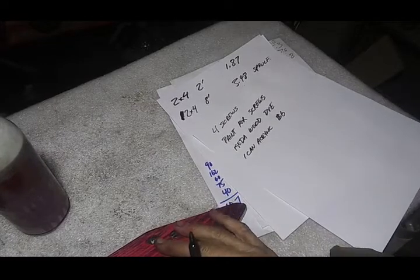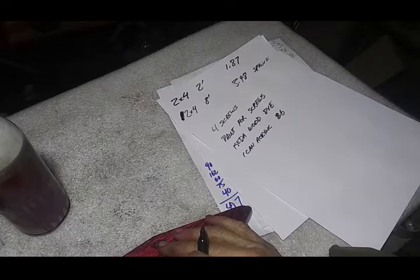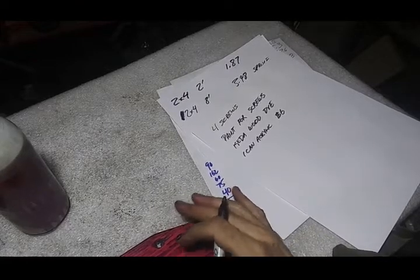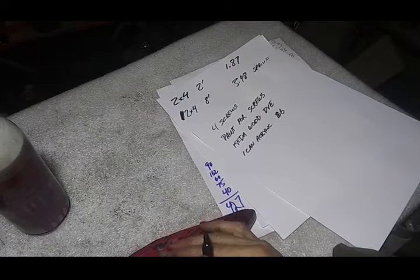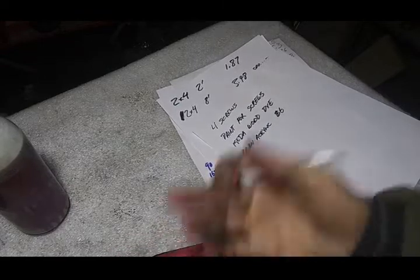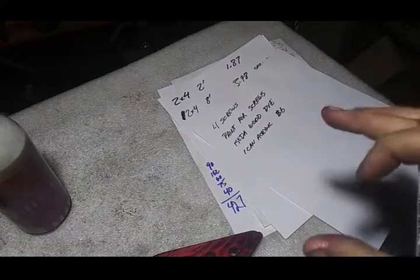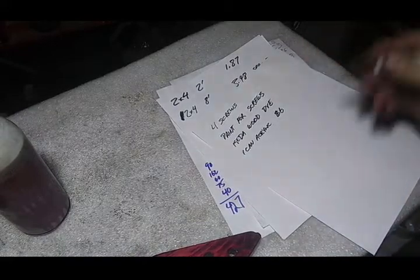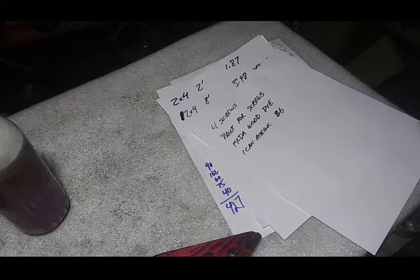And now that I know the number of coats this took, I'm estimating that it'd be about an ounce, one fluid ounce, about a shot worth of poly to do a single coat. And this was 4 coats, so it'd be about 4 ounces of poly, and I got a gallon can. Or I can go and look up online and see what the smallest can of poly you can buy is. And if they've got an 8-ounce can of poly, then we'd say, well, you'd actually do 2 guitars.